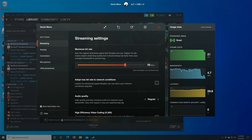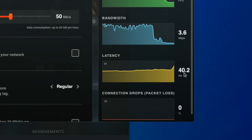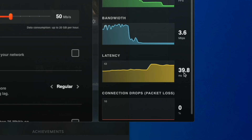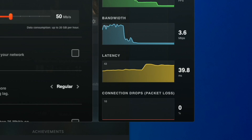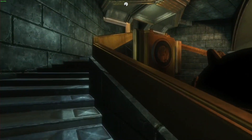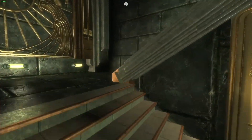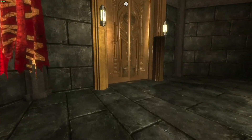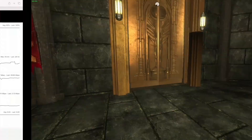Here is the Shadow service — I'm running this out of my backyard. If you look at the yellow chart on the right, you can see that the latency kind of doubled over the time we were watching it. I think that involves the handoff from one satellite to the other and what ground station that satellite might be connecting to. It's early days for this service, especially as far south as I am. You're not going to have a consistent latency experience here. But I did find the connection was very reliable, even though the latency was going to bounce around a bit. We were basically running at about a 50 megabit per second bit rate on the game, and it was able to keep up with it just fine — we weren't seeing anything dropping off or breaking apart. It was actually running better than it was at my brother's place in Vermont.